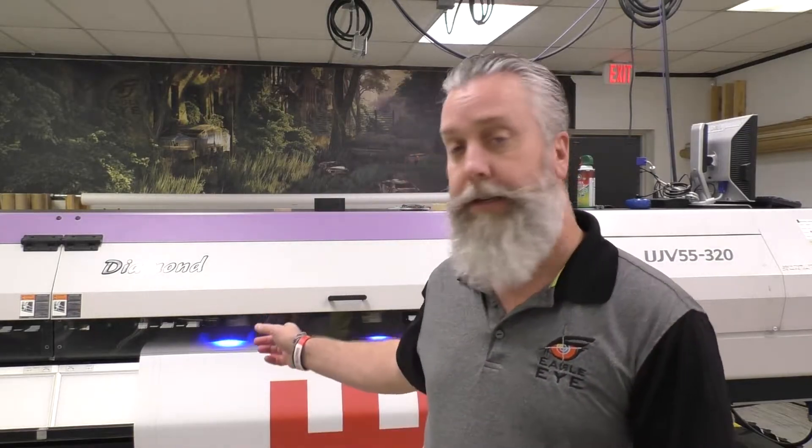What makes a UV printer different versus an eco-solvent printer? While this is printing, if you notice behind me as the carriage goes back and forth, there's a light that flickers on and off. What happens with UV is the ink is deposited on top of your material, and then as the carriage comes over, the UV light — which in this case is a medical grade UV light — burns the ink into your material. That's how it sticks, that's how it works. The ink in milliseconds, as you can see behind me, the light kicks on and off as the ink is dropping, and you can see the light burn the ink onto your material.